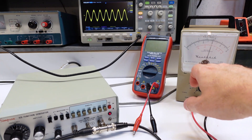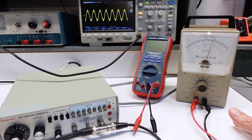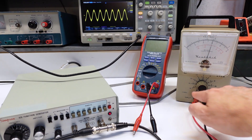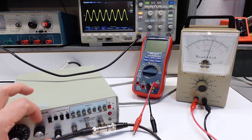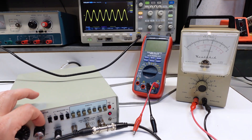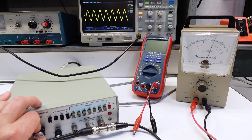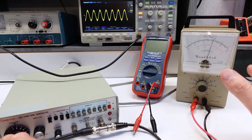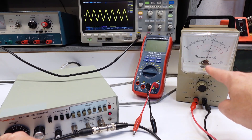One more thing before troubleshooting the hysteresis: I wanted to confirm the sensitivity of the overall circuit is working correctly. I set the range to maximum sensitivity — 10 millivolts RMS — kicked in a 30 dB attenuator on the Simpson, and dialed the amplitude down to about 6 millivolts. The meter is showing spot on. Setting aside the hysteresis issue, the overall circuit is working correctly at maximum sensitivity, which is a good sign that the tubes are working well.